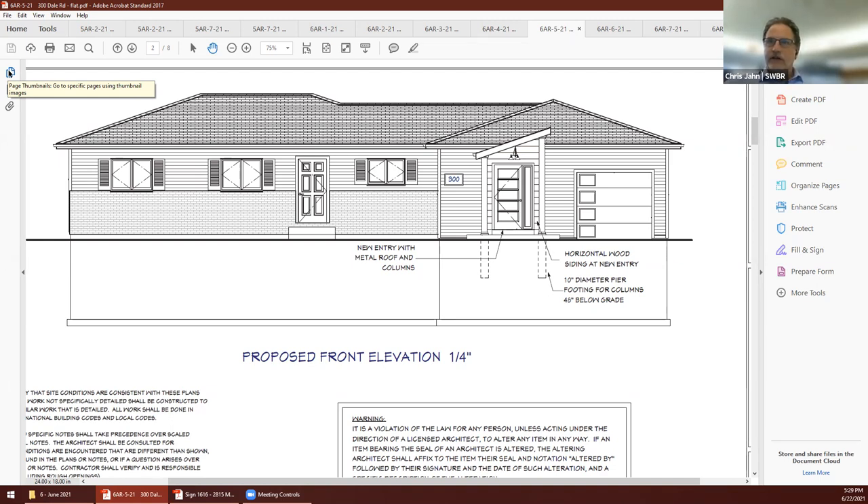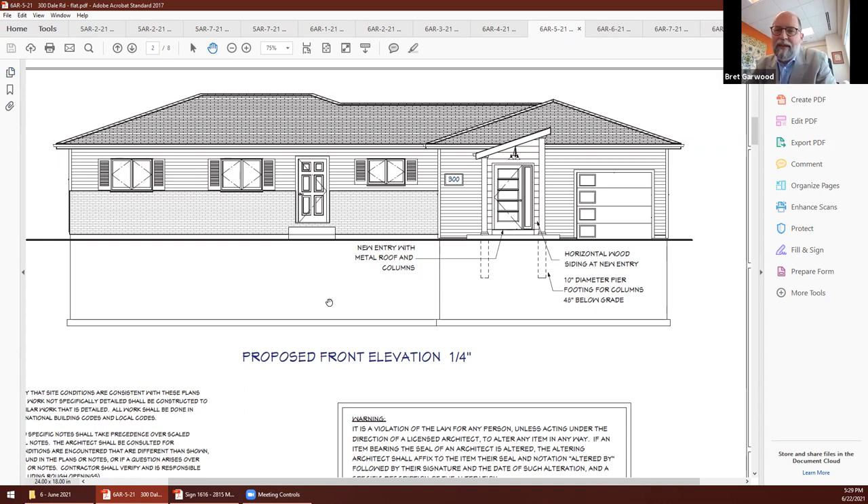Your door opens into the mudroom, and it looks like you're changing the siding to accentuate this. What's going on with that transition between existing and proposed? We may use extra siding depending on cost — if we use existing siding we'd fill it in, otherwise it's wood siding trimmed out. The existing vinyl will have to terminate into a vertical vinyl channel and there'd need to be some trim that covers that. Eventually we want to replace the vinyl siding with a more mid-century modern board-and-batten look, but that's not today's project.